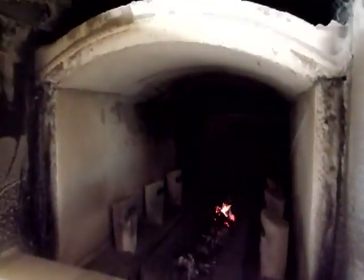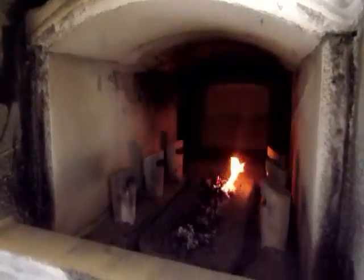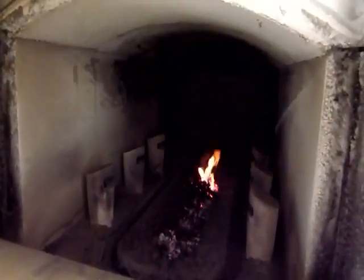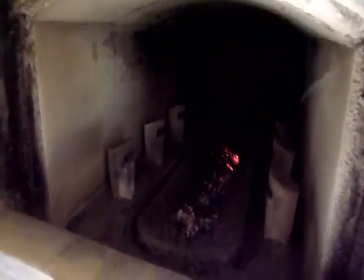So inside here you'll see a refractory panel and a burner. Primary air comes in down low around that burner, and then secondary air nozzles — these six cast iron nozzles on each side of the burner here.